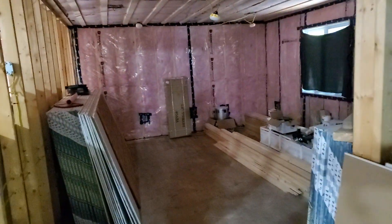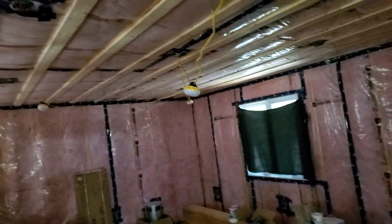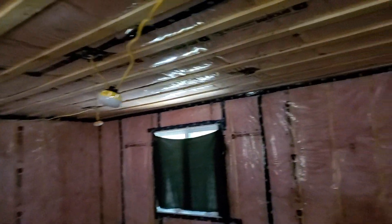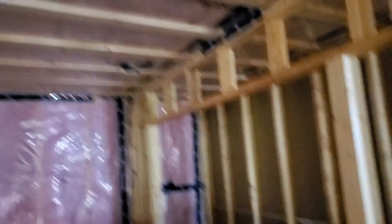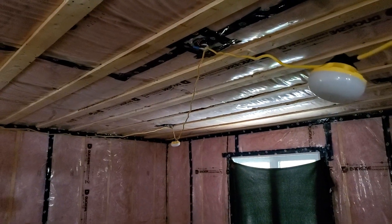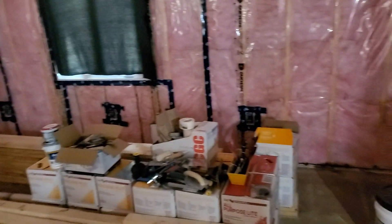This is the next room, the next job I'm going to be doing — getting this bedroom done. I got 12-footers to go up into the ceiling. I'll get all the 12-footers done and then work around the wall. I'll put the ceiling up first, which you should. Once I'm done that, then I'll get this done. There's all my mudding supply and everything like that.